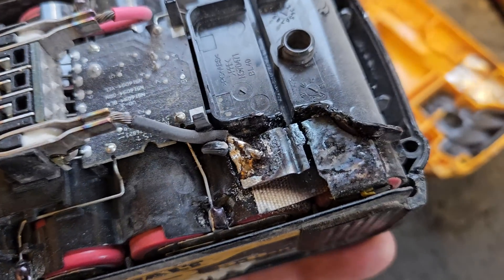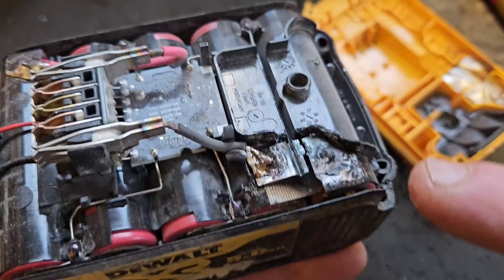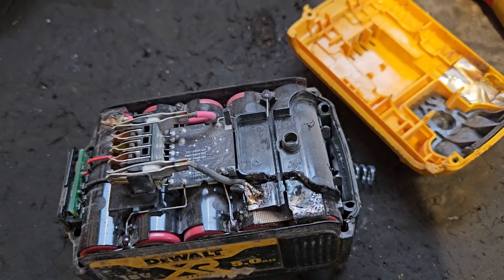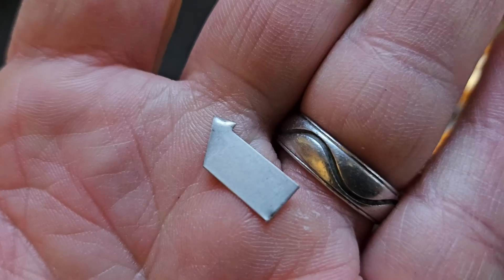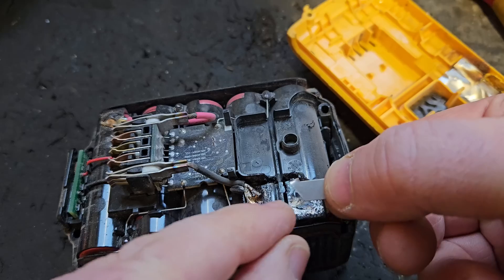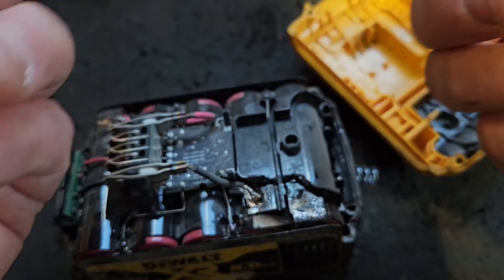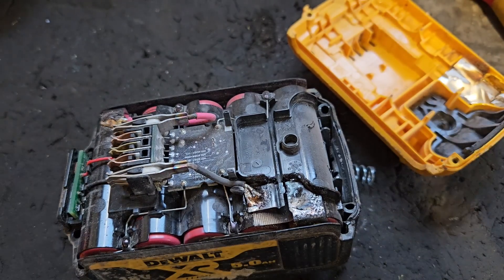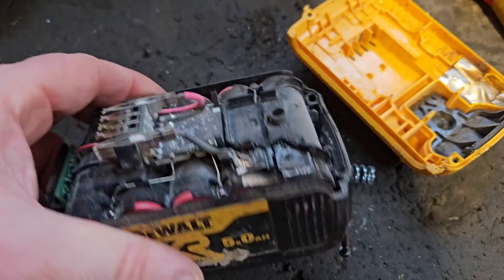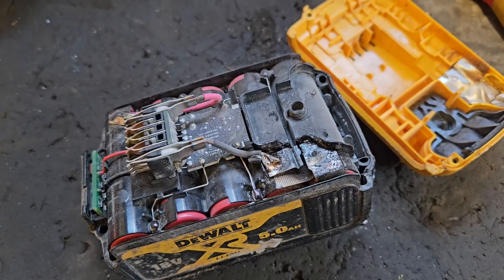But reconnecting this properly — you could solder across that with some heavy solder, you could do many things — but I use light nickel strip, and that is perfect for the task. Stuff like this is very fine and you cut it in half basically and put it across here, and you have another fuse just the same. It'll probably be one bit lighter than the original. I never put it heavier than the original — people complain in the comment section thinking I'm putting heavy strip on, but I am not.